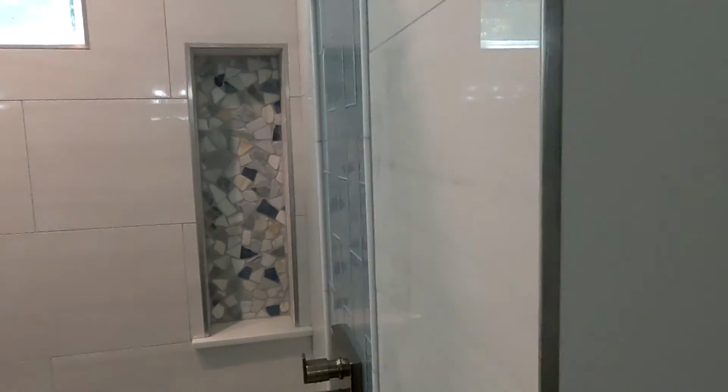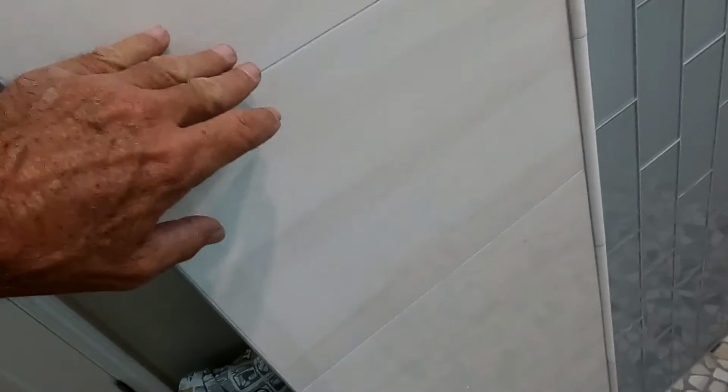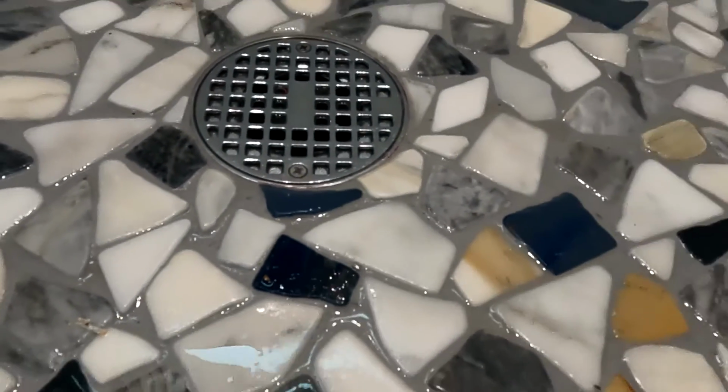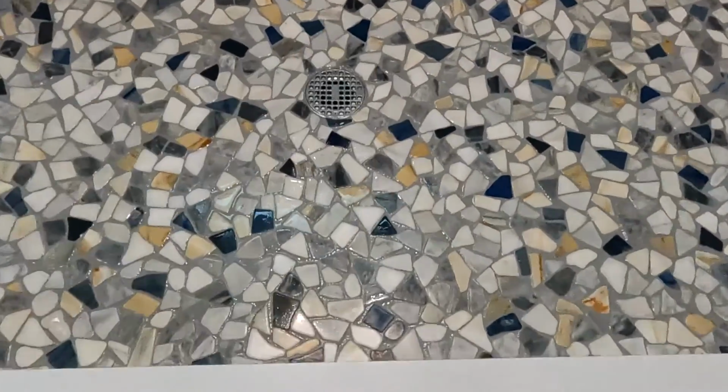And then the Schluter trim, by default I call it Schluter, but it's just the aluminum trim that goes around everything, as well as the outside over here. That's about it. This shaved rock tile looks very nice, and of course the grout is more or less like a DeLorean gray, right? But when it gets wet, it's darker, and so that's what's going on there. The nice $28 drain instead of a cheesy $12 aluminum one that Home Depot also sells is always better. Then I do a little taper cut with the tile around the edge for positive water flow to go down.